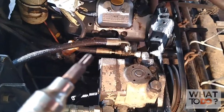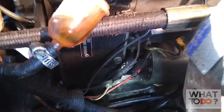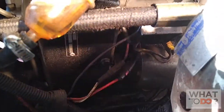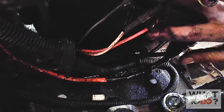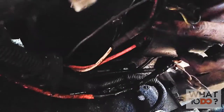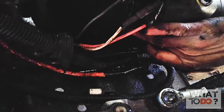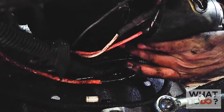So there's the star bit I used there. Did we get it out? I can't see in there yet. There is another one to show you — so it is in the front of the starter, we got that top bolt out. That was up top. Now if you feel underneath of the starter you're gonna feel another star head on the very bottom of it.